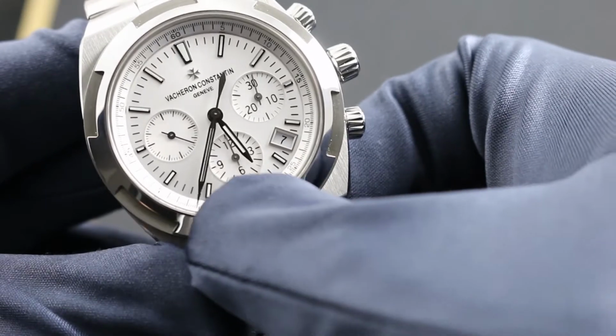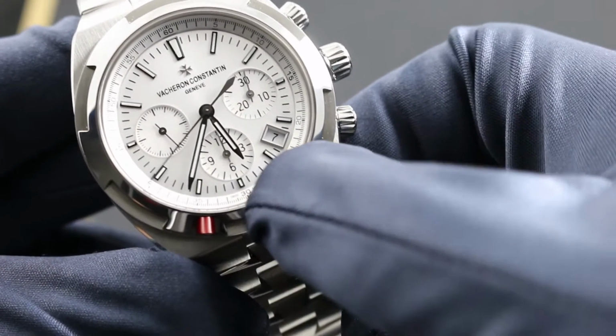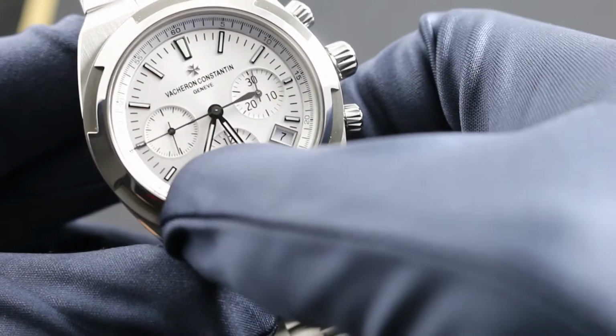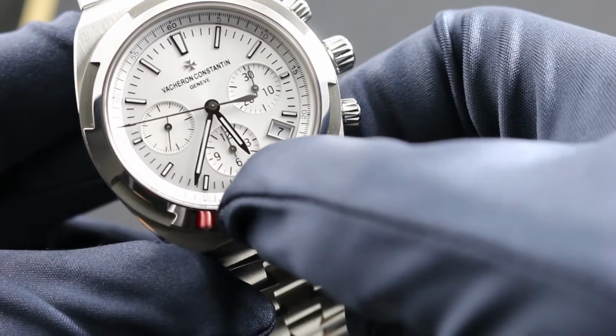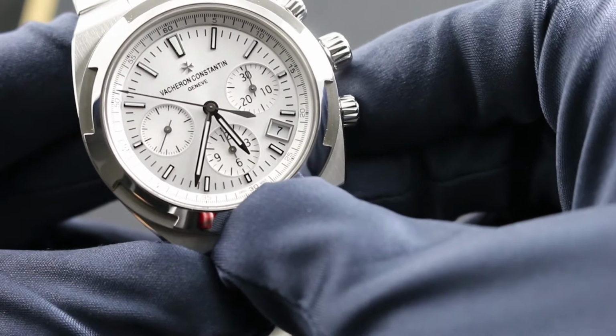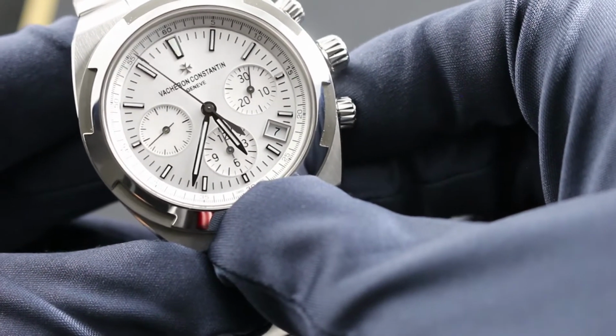It's critical to note that the watch must never be rapidly advanced through the date, as the date set is in action by automatic means between 8 p.m. and 4 a.m. Never use the quick set date during the hours of 8 p.m. and 4 a.m., as attempting to jump the date while it is engaged automatically can damage the mechanism.